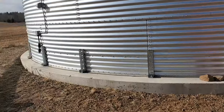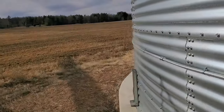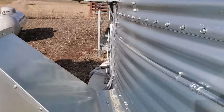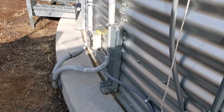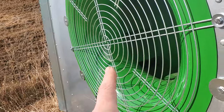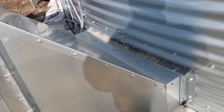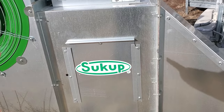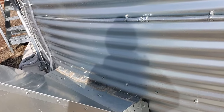On the other angle to this: I got a propane tank out here because I thought I had to preheat the air. I got a propane tank with a differential thermostat installed — that little gray box down there — which introduces heat into the plenum between the fan, powered by a 20-horsepower motor, and the plenum goes under the floor. The problem, according to Sukup, is that the airflow through here isn't even, so you get a differential in heat applied and the grain won't dry properly — it'll dry very unevenly.